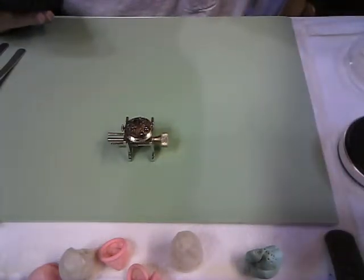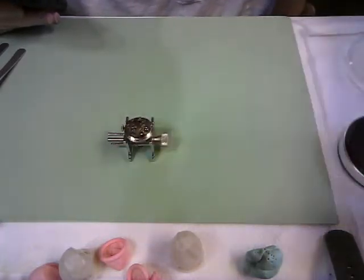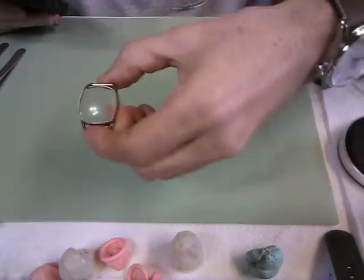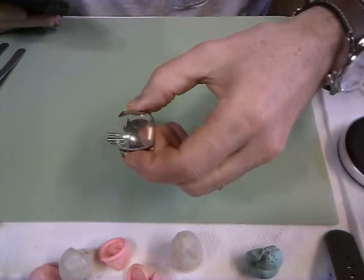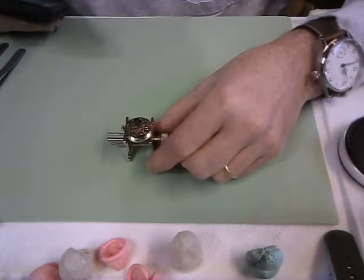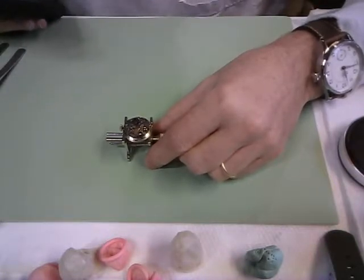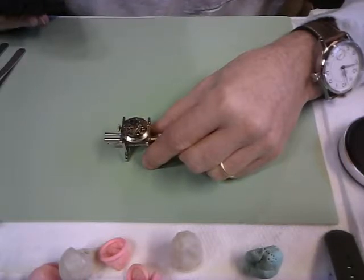After brief research, this is the particular dial that has been removed, along with the watch case itself. The reason I don't have finger cots on is because all of this will be cleaned. The watch did not work at all when I received it, but I was able to get the balance to turn after providing a little oil to the end stones.